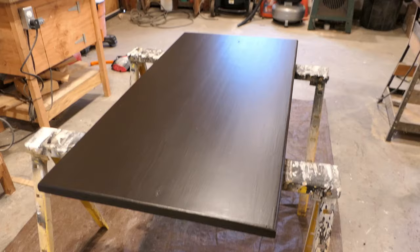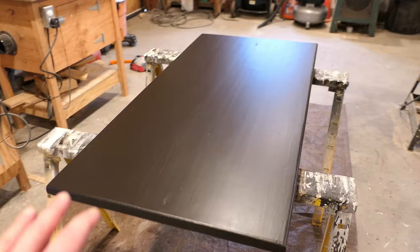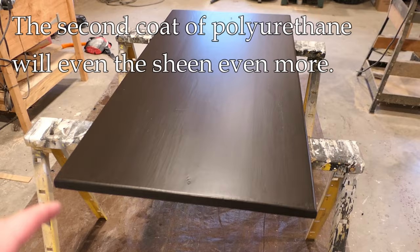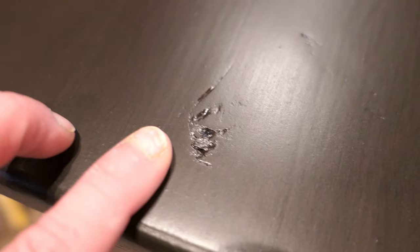That's the first coat of clear finish — it's been about an hour. You can see the sheen has evened out tremendously; it's really nice, and that's only with the first coat. I'll put one more coat on for protection and a little more thickness, which will also help even out the sheen a bit more. If I get close you can see the imperfections that were there before are still there, but overall the effect as far as color is good.